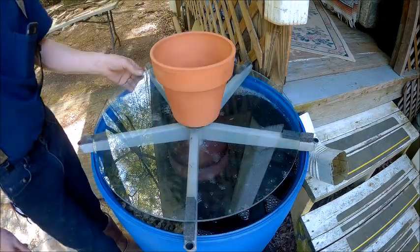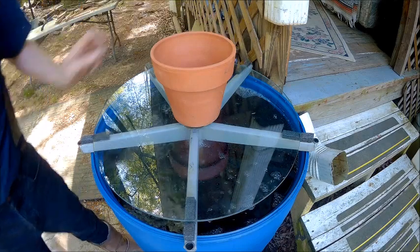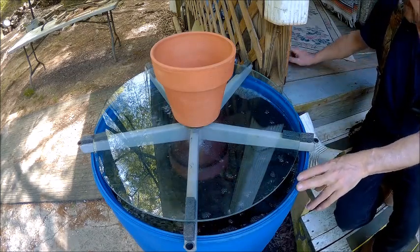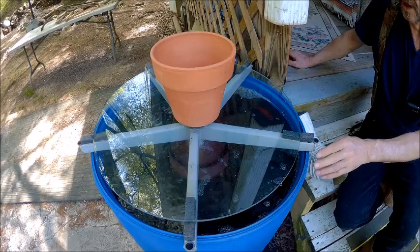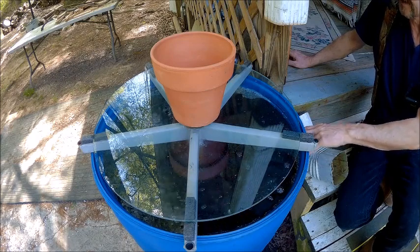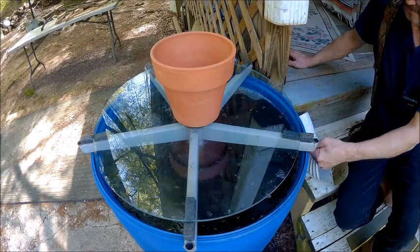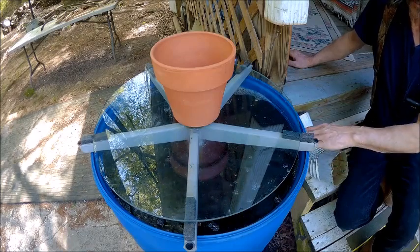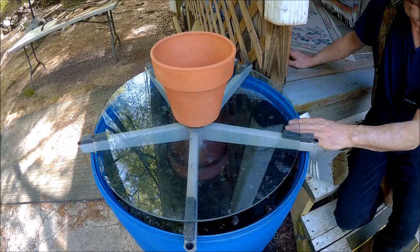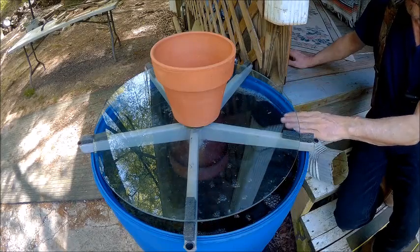You don't want to close it all in. I've got to figure out the best method for getting the water from this downspout down into that. This will also help keep the fish from jumping out. If I lower the level of this water about another two inches — down to the square where it's flat around the sides — drill a hole and put an elbow here so the water never goes past that point. It doesn't overflow here because sometimes it flows in here so hard it blows the water out the other side, so I want to regulate that somehow.